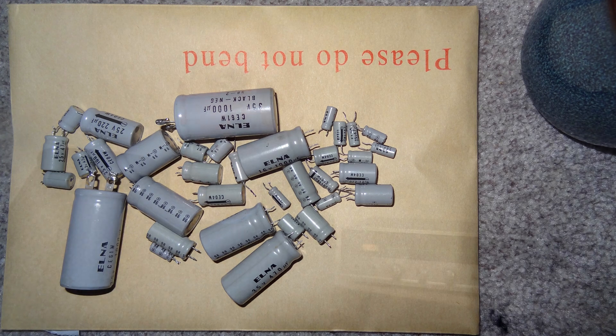Hi and welcome to my channel. A little while ago, just a few videos back, I did some capacitor testing on 50-year-old capacitors to see how they stand value-wise compared to what they should have been. I used a cheap multimeter with capacitance measurement, and people pointed out it's not very accurate — but I still think it gives some indication of how far out these capacitors are.